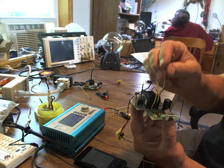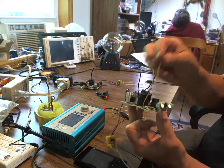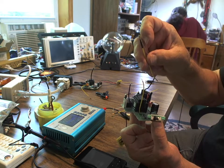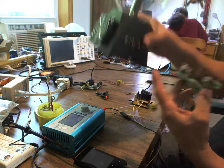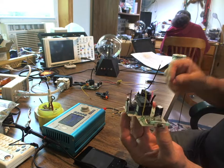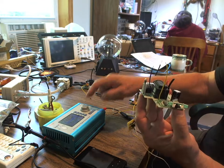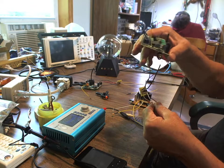This yellow wire goes to the opposite hole, which is actually connected to the onboard oscillator. When this is plugged in or soldered in, the output at the capacitor is a controlled pulse that I'm going to feed back through the switches on the plasma ball. That's going to be the internal oscillator option — when you flip the switch all the way down it runs from the internal oscillator, and when you flip it all the way up it runs from a Spooky or function generator.